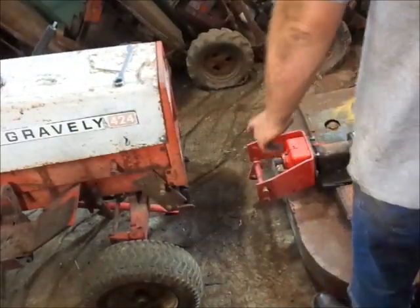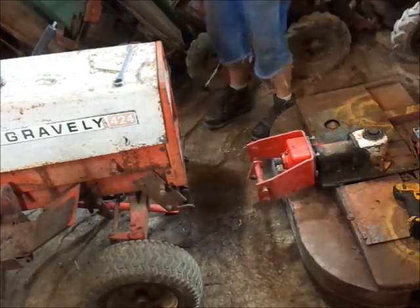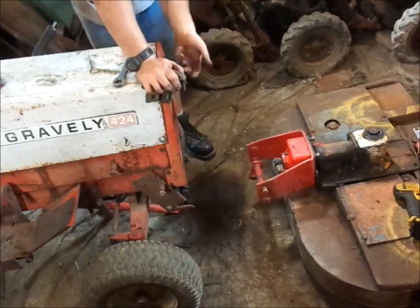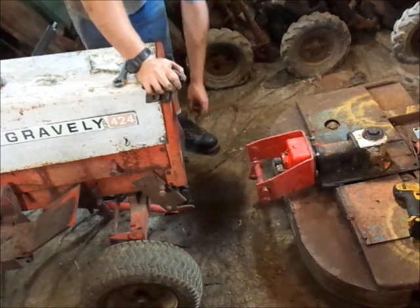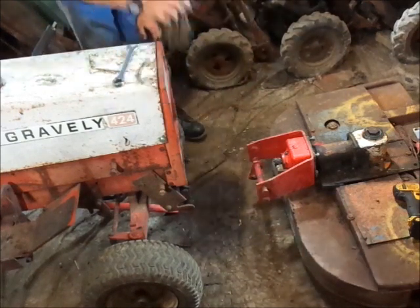Alrighty guys, so basically this is going to be installing a 4-bolt adapter setup on the front of this. This is on a 67 424, but they're all going to be very similar. Basically I already got the drive shaft installed and figured out. I have the correct U-joint I need installed on here. My latches all work. Maybe a little stiff, but they'll work.